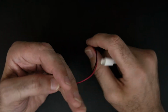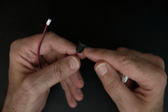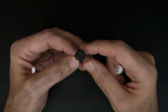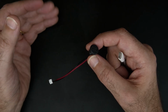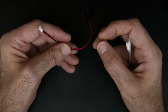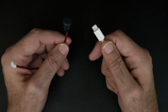That's because the manufacturers use this cheap kind of 2-wire jack that doesn't have any logic built into it. And they'll give you a cheap USB-C to USB-A cable, and that's actually the secret. The cable, because it's USB-A on one end, will always provide 5 volts. And that's why the darn thing only charges using their cheap cable, and your nice charger won't work. I don't want to have to deal with that.